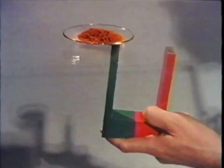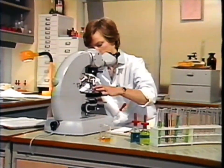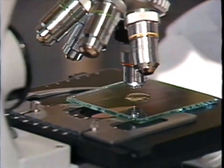Now there's a dish of loose metal particles. When the magnet gets near them, see how they all line up in one direction. But when there's no magnet present and you examine the particles under a microscope, they're jumbled up all over the place. Every one of those tiny particles is in reality a very weak magnet - each particle has a north pole and a south pole, but they're so weak they're pointing in any old direction. But when a large magnet passes near them, immediately they all line up in the direction of the large magnet's own magnetic field.